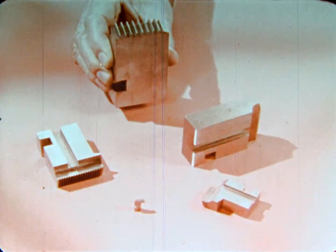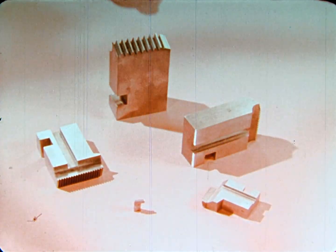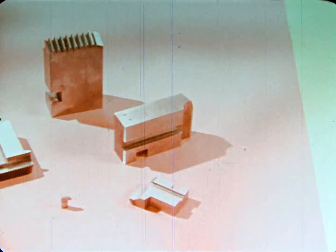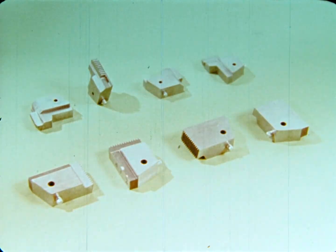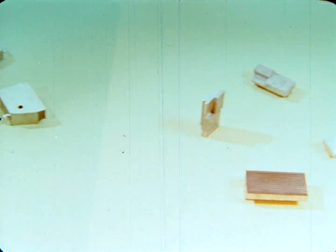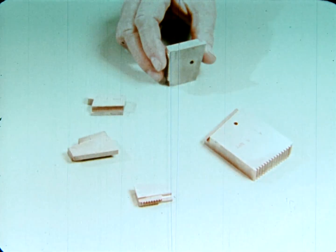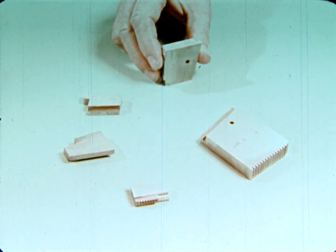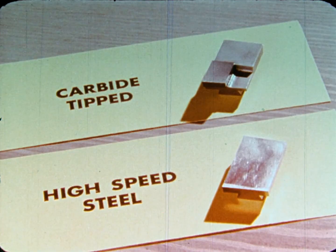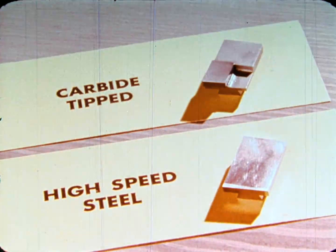Geometric produces several different kinds of chasers for die heads. They are the D, the K, and the tangent type. The same kinds of chasers are also available with carbide tips. S-type chasers for taps come in both high-speed steel and carbide. Cutters for die head turning are available in carbide tipped as well as in high-speed steel. Special cutters can be furnished for end pointing and forming.